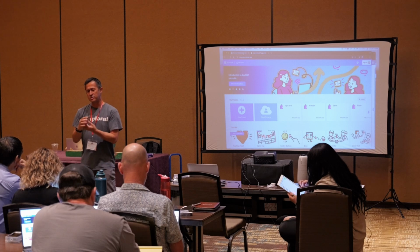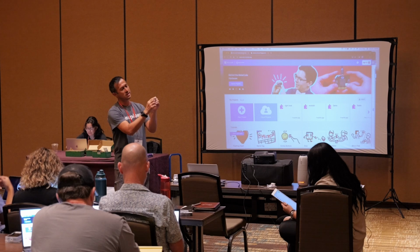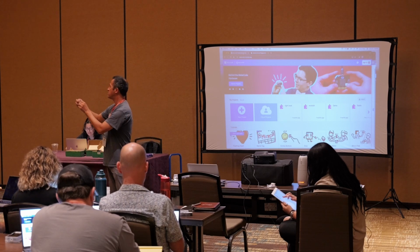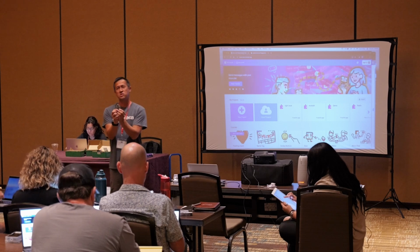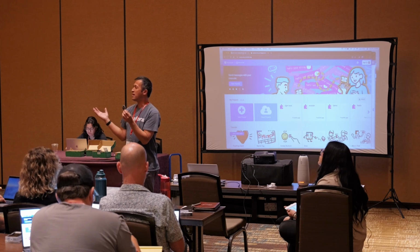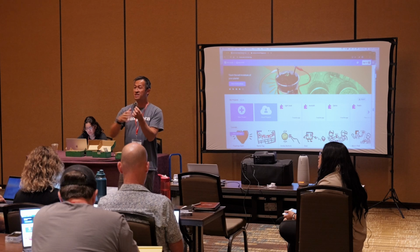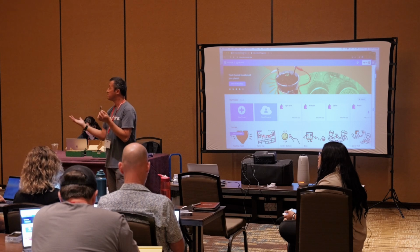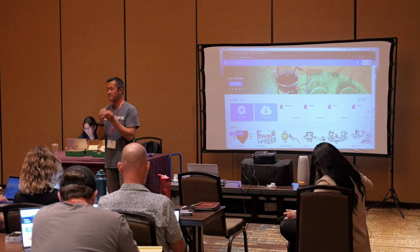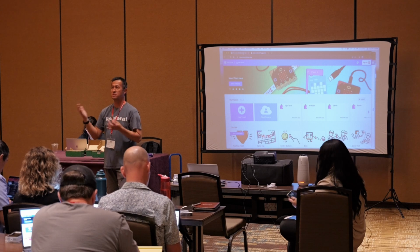The other thing that this Circuit Playground Express has is around the edges, you'll see that there are those little copper-colored, brass-colored holes. Those are called pins. And so with that, we can connect wires to other devices. So maybe I want to control a motor. So I use certain ones of these pins, and I connect it to a motor, and so that could be my output. So maybe my input is that it senses a certain amount of light, and then the output is it turns the motor on. So that's kind of what we do.